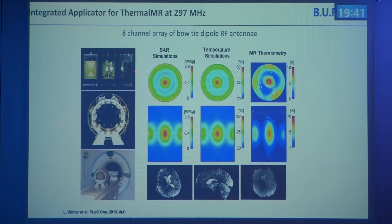The first part of this work was developing bowtie dipole antennas for operation at 300 megahertz. The antennas are submerged in a box filled with heavy water that allows the shortening of the antennas. An applicator of eight antennas arranged in a ring was designed, and we did first simulations and experiments in a homogeneous phantom, showing we are able to focus the hotspot and create a temperature increase measurable with MR thermometry at 7 Tesla. We also saw very nice imaging qualities with these antennas.